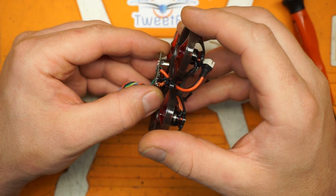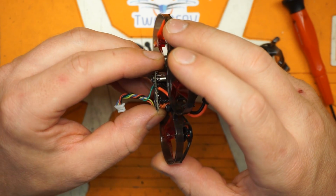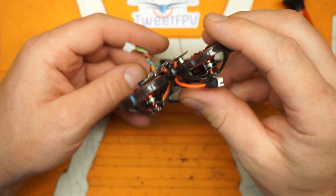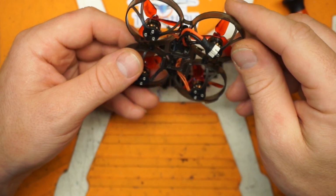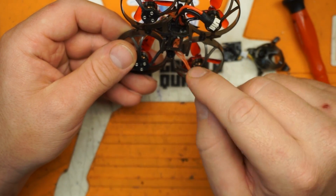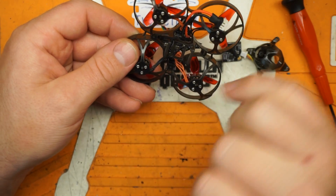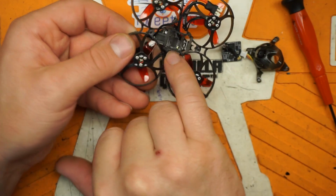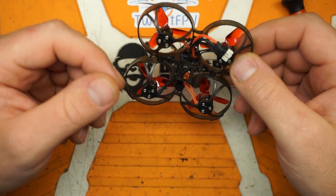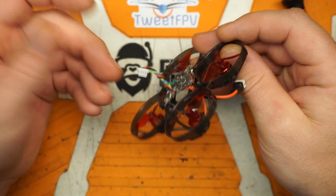So as you can see in there, there's no longer any plug headers for the motors. All the motors are direct soldered to the flight controller, which does make serviceability kind of difficult, but not all lost. You can take the flight controller out and work on the bench. If you remove your props, then your motor screws, you can weasel your motor out through here and out through the little side hole in the frame here, and then you can take the whole assembly out